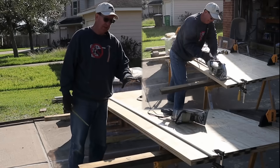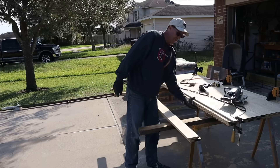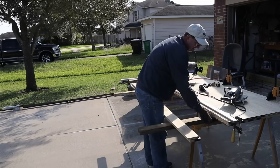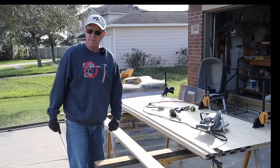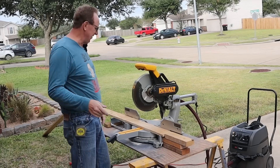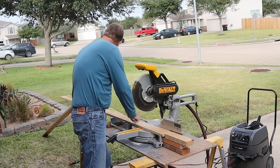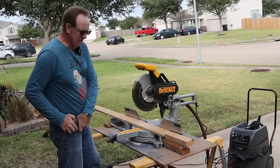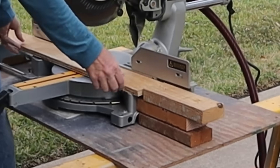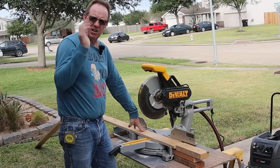I want each pair to be a match — so if there's just a hair of variance, it won't matter. I've got a support board under here that I keep moving in. Center to center is seven feet, and I'm cutting an inch off that, so I've got it marked at six foot eleven. That gives me a half inch at each end for play. Instead of measuring all of them out, I've rigged up a little stop system so I can just cut all of them consistently.